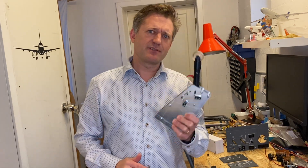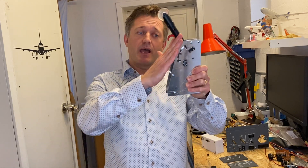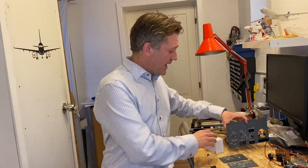I was a bit puzzled by that. I thought, isn't this the correct 15 degrees? Well, this is of course the correct 15 degrees, but it turned out that my main instrument panel had come loose at the bottom and was sloping at a 20 or 25 degree angle, so it couldn't fit. That just tipped the iceberg for me, because then I had to make some kind of mount and fix it so that it would be the correct 15 degrees again. So by now I had all the panels out more or less because I had to access the annunciators, and I promised myself to remake the back with the connectors and make some support for the main instrument panel.